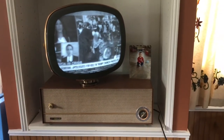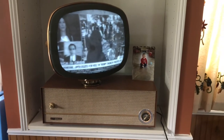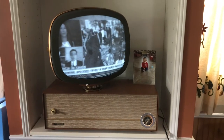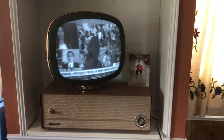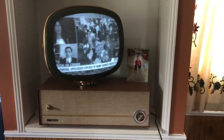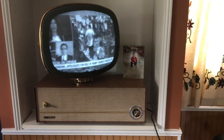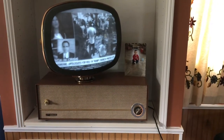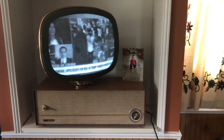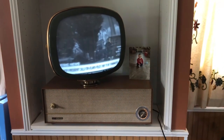What I find amazing about the tuner on this Predicta — I have a Blonder Tongue Agile Modulator in the basement, which is right under where we're standing here. But the only thing I have connected to the antenna terminals on this TV is just a matching transformer. I anticipated having to put rabbit ears on it, but didn't have to — just a matching transformer attached to the two 300-ohm screws. And that's the picture that we get.